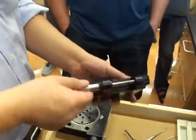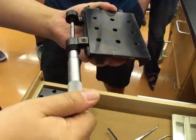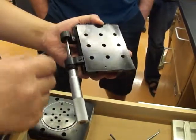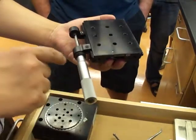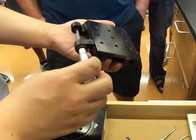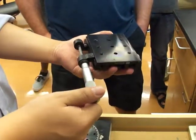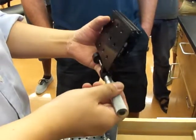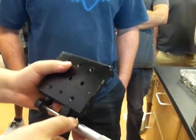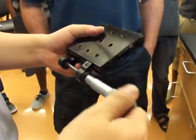And this one is the translation stage — a much more conventional way to read it. It's a micrometer, though it's a little stuck. We're replacing this with some higher quality ones. This one is not very stable; with only one screw securing it, it's very unstable. It's already stuck — so 5 millimeters range. There's actually a half-millimeter scale, and with a half millimeter you can cut it in 50 times, so it's one hundredth of a millimeter accuracy. There's also a vernier that cuts things in 10 different scales, giving you one thousandth of a millimeter — that's why it's called a micrometer. The accuracy is one micron, one thousandth of a millimeter. But it's stuck, so we'll replace it.